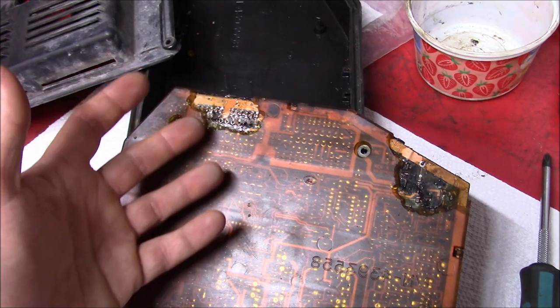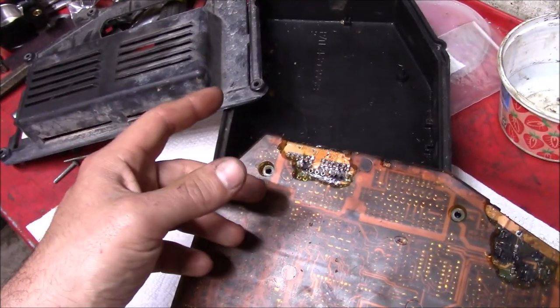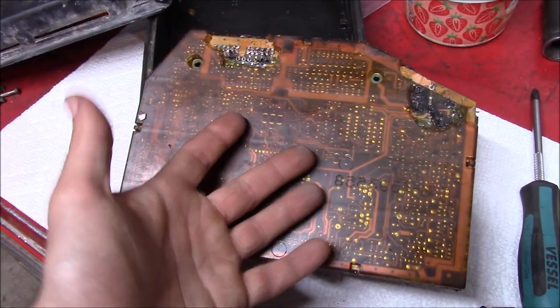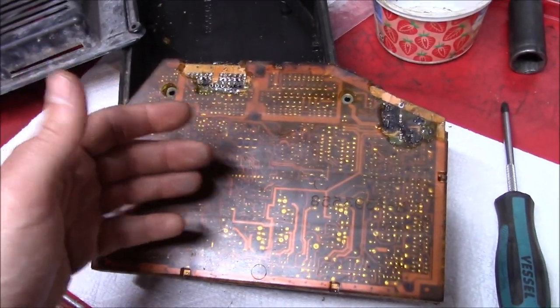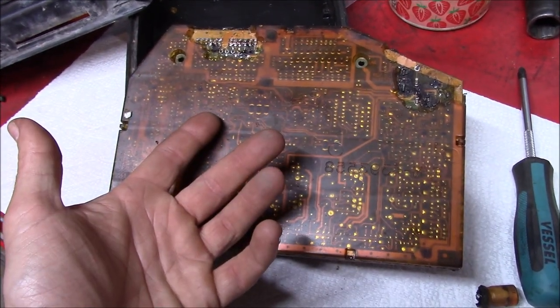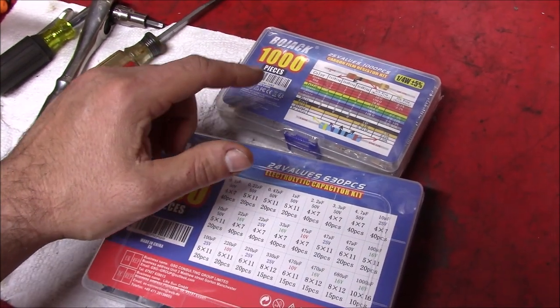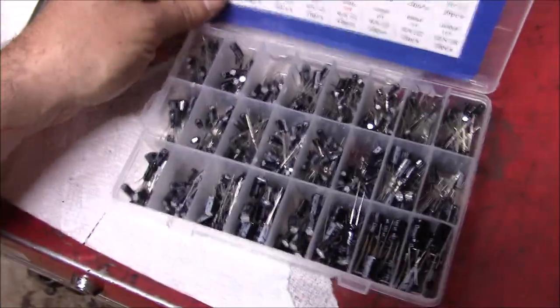After further research, this type of ECU box is used on other Chrysler products — a lot of older Jeeps have the same shell, though the circuit boards are different. They have the same types of problems, and there are kits out there — a four-pack of capacitors — because that's far and away the most common failure. You can get resistors and caps pretty cheap in bulk: about six bucks for resistors and under ten bucks for all the different caps.